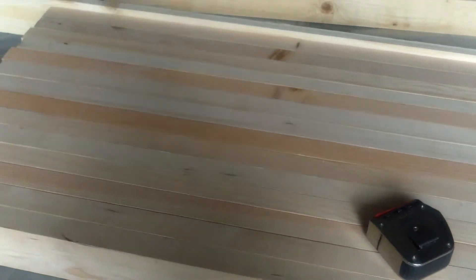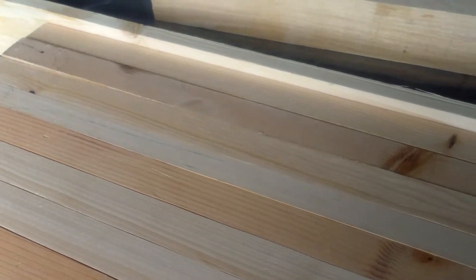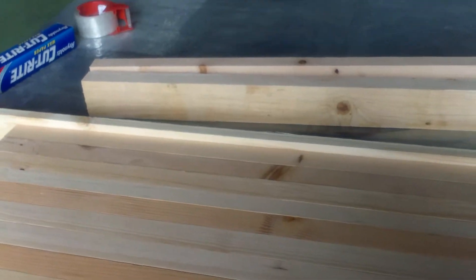Here's the top laid out — nothing is glued yet. I'm going to need to buy a bigger piece of wood, like a 1x6, for the backsplash to raise it up a little. There are some knots I couldn't avoid since the other pieces were worse. One board is bowed slightly — you can see it rising — so I'll try to flush it with the top and sand it down. I've also got a small gap area I'll fill in with sawdust and wood glue.